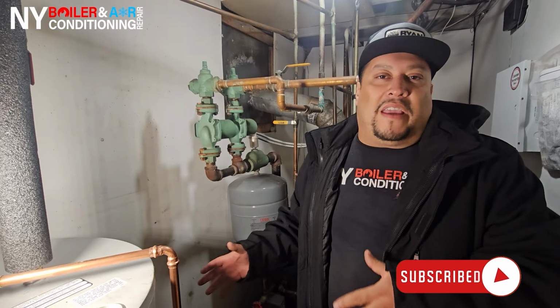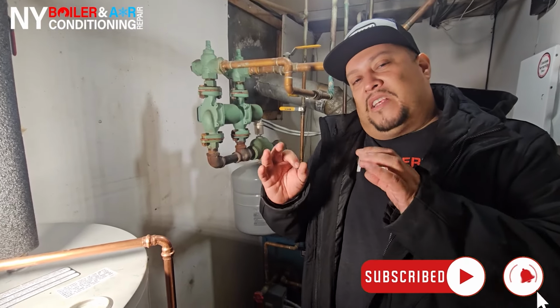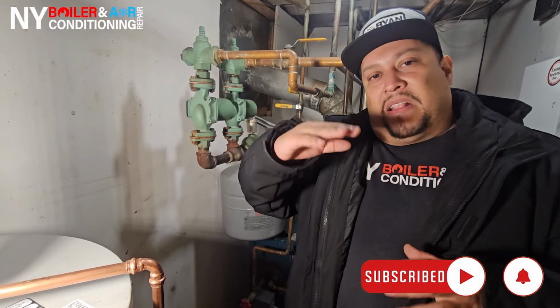So guys, in this particular case, it looked like it was a combination of maybe just the vibration closing up the damper, and also the nozzle, even though it's new, because we changed it a few weeks ago. We're going to change it again.